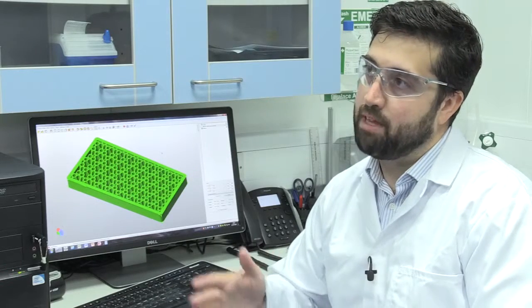Hi, Alan. Usually the customer comes to us with a geometry that is too complex to be manufactured any other way. They usually send us a 2D drawing or a 3D model of the object that we then need to tweak a little bit to adapt that to our printing process. Then we need to do a slicing process that we then feed to the machine and translate it to something that the machine can read and print afterwards.